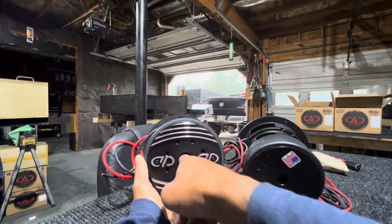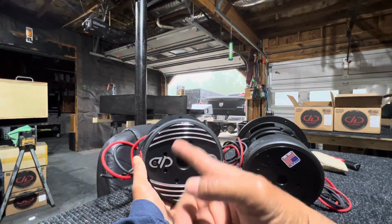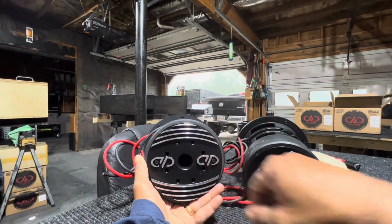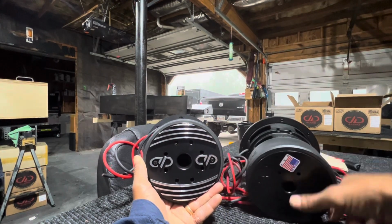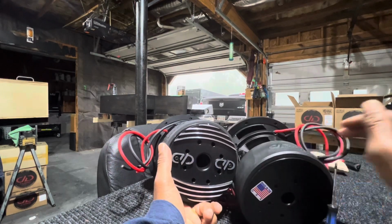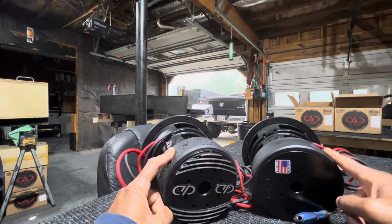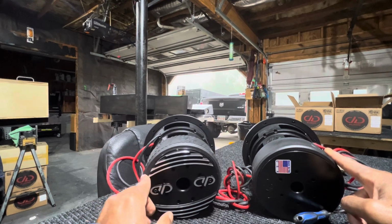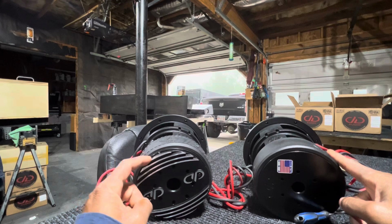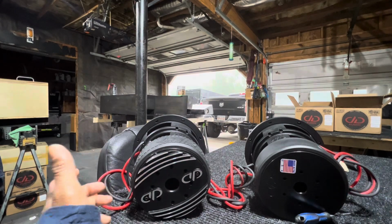This added vent hole, this increased space, cools the inside of the former. And there are holes inside this up top to increase the airflow on the inside of the former. And then look how large the holes got in comparison. You see how big the holes are? You got 6 holes on the 1506. On the 1506A, you got 8. Substantially larger holes. Also, he had to modify this back plate on this motor and made it slightly bigger to accommodate this larger vent hole, because the voice coil is still the same on both models.